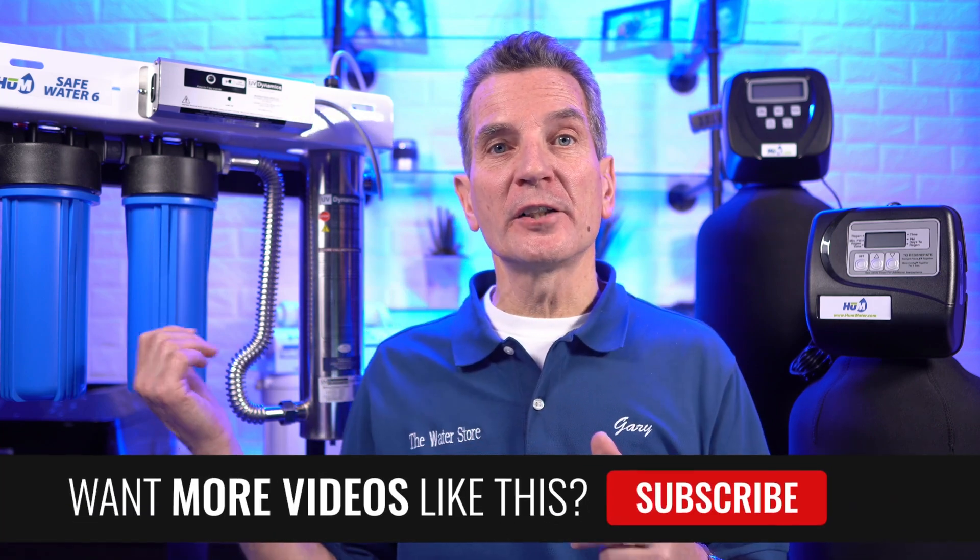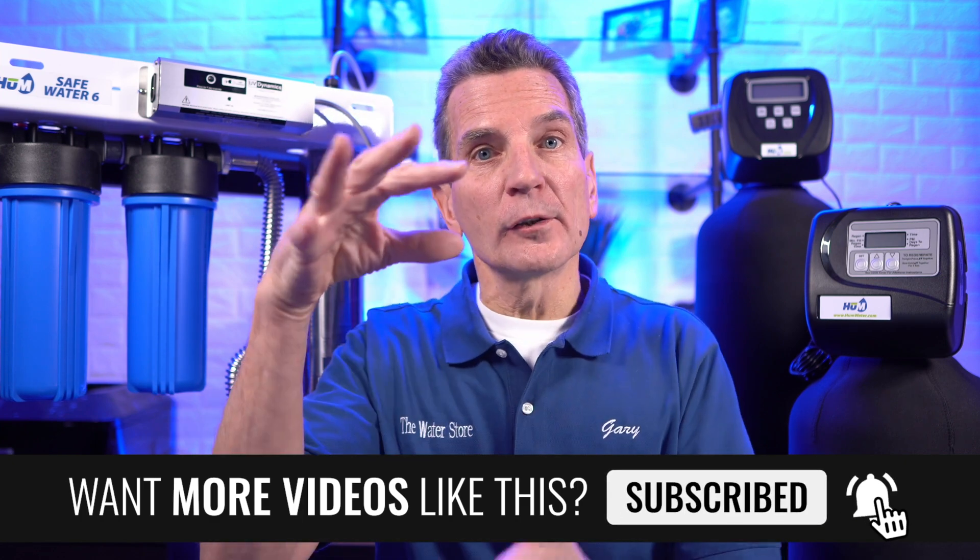Whether you're on well or lake water, if you have a lot of dirt or sediment in your water, those cartridge filters inside UV systems or standalone blue cartridge-type filters are going to clog very quickly and you'll be constantly changing them. In that situation, there are a few things you can do upstream to do the heavy lifting. One option is a backwashing filter — dirt accumulates inside for four or five days, then it automatically backwashes to the drain to clean itself. The beauty of these systems is there are no filters to replace, no chemicals to add — every three to five days it goes through that cleaning procedure automatically.